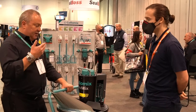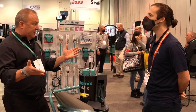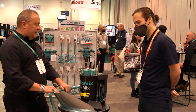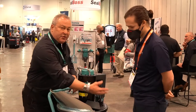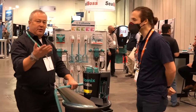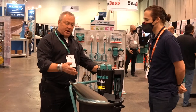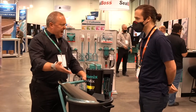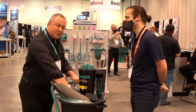When you're using it, you simply start off by adding the water. You can mix up to three bags, so add the water for all three bags. Make sure you hook up your shop vac here so you can pull the dust out when you start pouring the bags in. We certainly don't want the dust in the air, so start adding the bags as you turn it on. You run it for about a minute and a half, then turn it off, it burps, and scrape the edges.